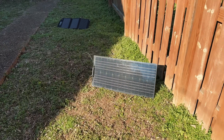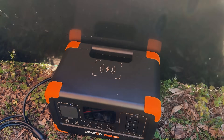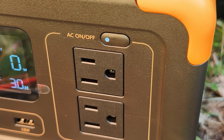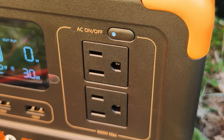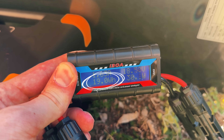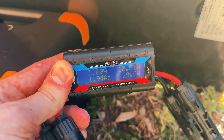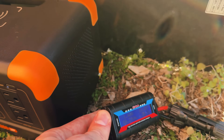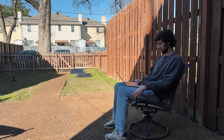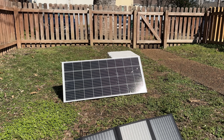About 20 minutes later I'd gotten excited about the $150 setup again. The battery started at 64% and it's up to 69%, though I realized I'd left the AC outlets on, which was draining the battery a bit. The watt meter only showed 19 watt hours, though we were still getting 30 watts input. These cheap meters can be unreliable — you'd expect around 30 watt hours based on the numbers we've been seeing. If the meter is right, that's really low output for a 50 watt panel, and it would take around 14 hours of good sun to fully charge the power station.